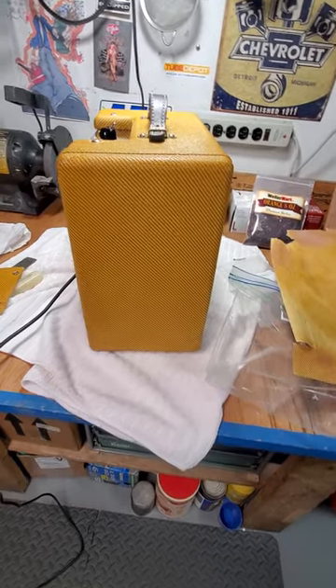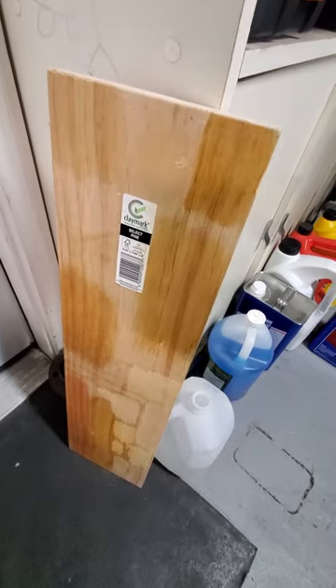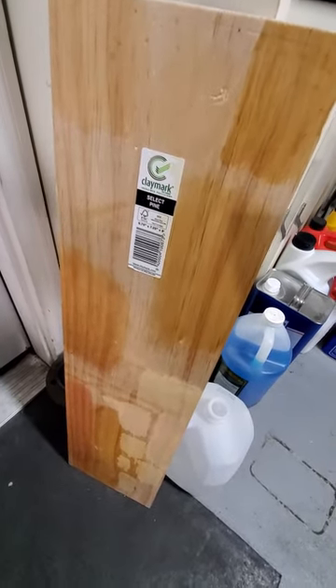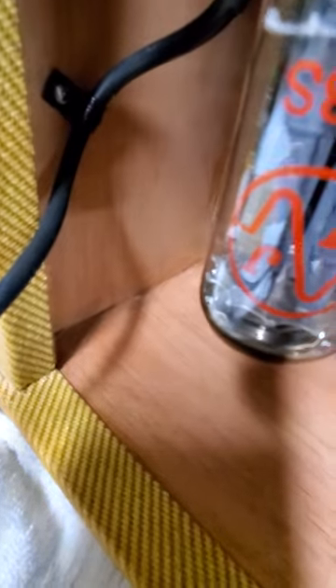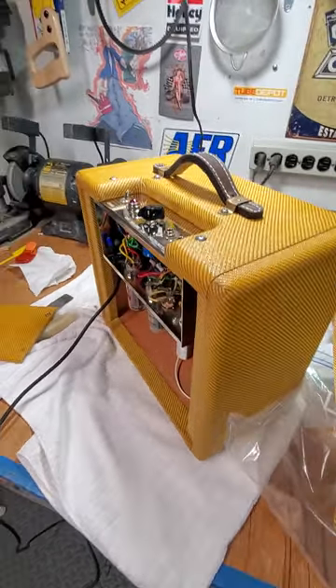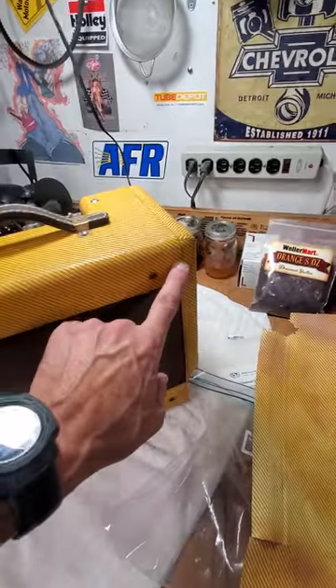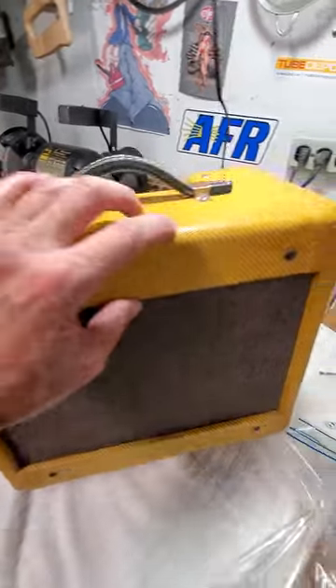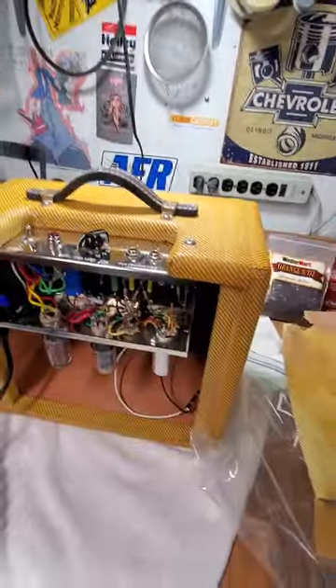This is a narrow-panel style. It's regular Home Depot pine — three-quarter by seven-and-a-quarter, eight-foot board, a $7 piece of select pine. I actually finger-jointed it using a miter saw with a sled I made up. Originally I had the top all opened up, but I put in two pieces to make it look more like an original Champ.